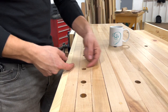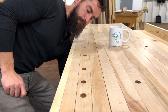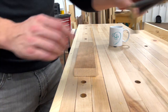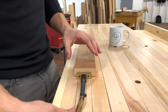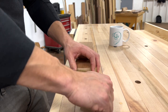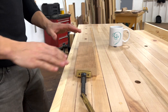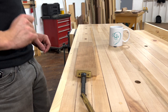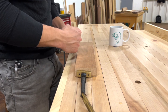Here's what I do to work around that: if I need to hold something flat on my workbench horizontally, I use a combination of two things. First are the dog holes — I can pop this bench dog up, put my piece in place, and then I have this little device which acts as a mini tail vise that slips right into a dog hole. I can slide it right in there and lock this piece down, and I'll tell you it's really rock solid. This is from Veritas — I'm not sponsored but I highly recommend it.